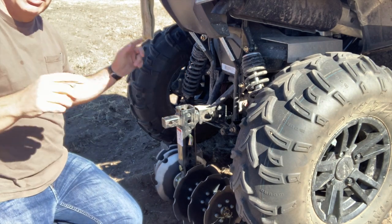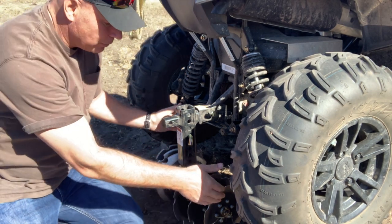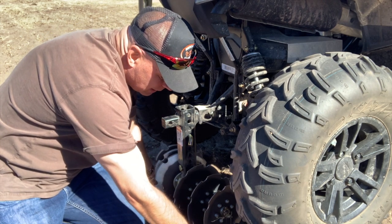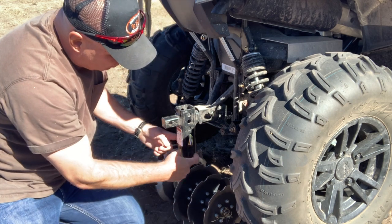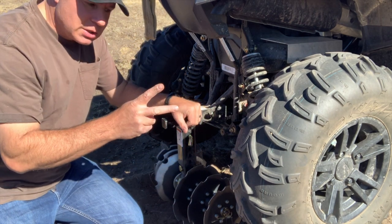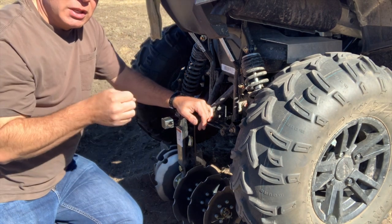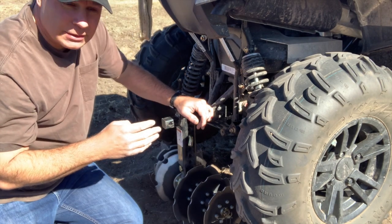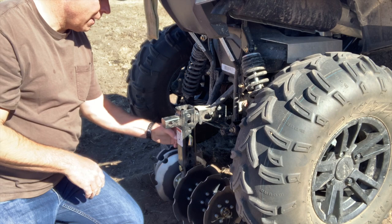There — I'm ready to plow. But what you're going to have to do the first time: if you're on level ground, you set this at the height of the ground, then move it up two notches, which should give you two inches of depth. Then once you add your weight, that's going to give you the three to four inches that it advertises.